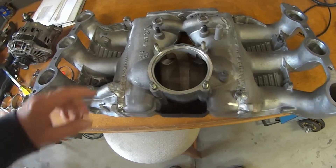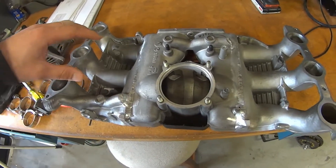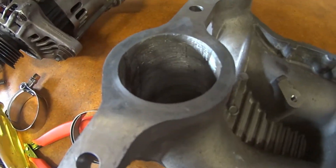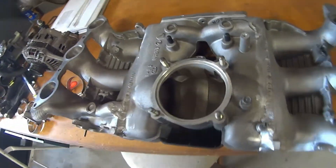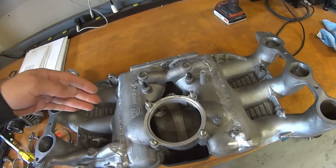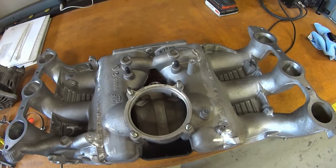While I had all this apart there was some oil and stuff inside, so I took the time to clean up the inside and really make sure it was as clean as it could be — opportunity to get in there. I also went ahead and just took a file to the places I could reach anywhere on the inside of these welds, so we don't have any leftover slag.